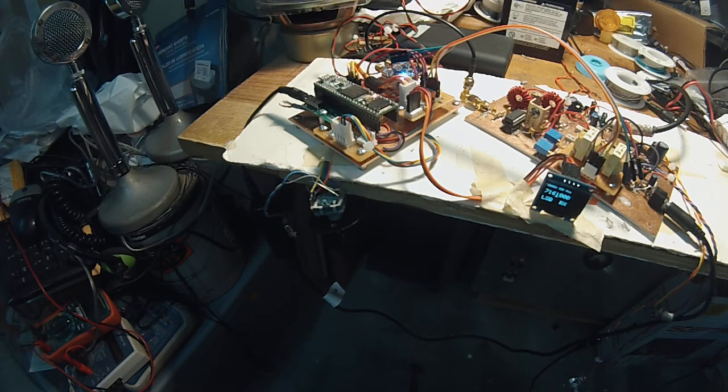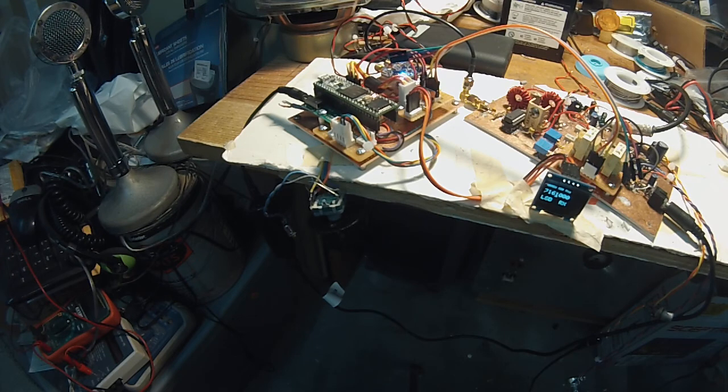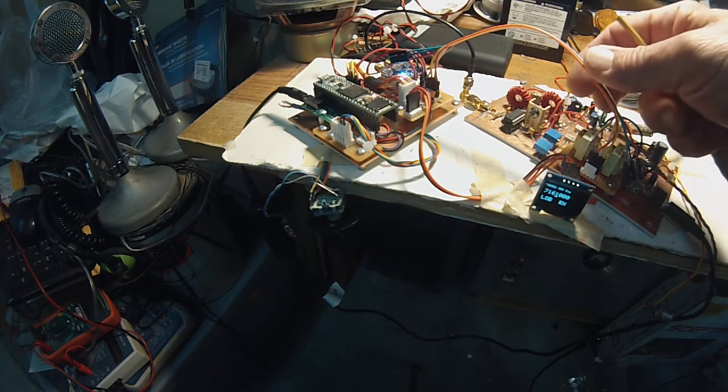I have a little more rewiring to do, but I rewired this board because it was a problem. I did put a ferrite core on the leads coming out of this relay, and this relay here, this little orange device, controls the line in, line out. So there are four wires for the line in, line out, for the I and Q channel. And then I did run a ground, so the ground is continuous off the secondary side, not connected to the board, passed right through, and so the ground goes into the codec. And that's one of the things I think was the problem with some of the hum before, that we were getting a kind of common mode problem with ground loops. So this has resolved that, and right now this is just a cable.